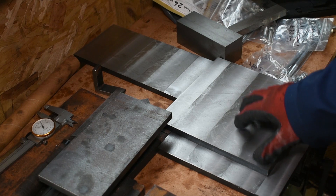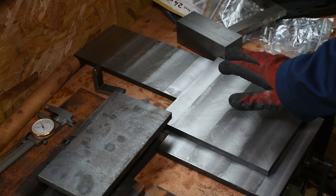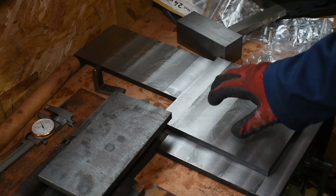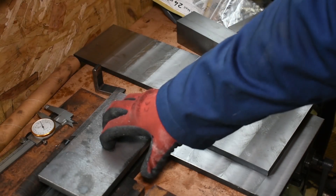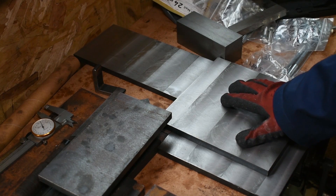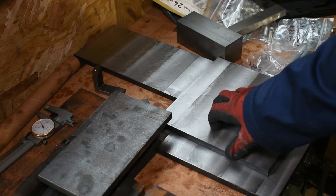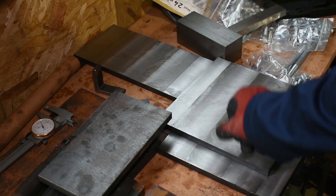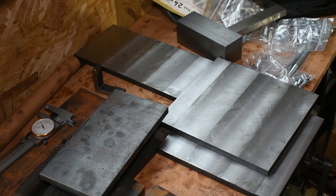What I've done from the cutting list is I've had some half-inch steel plates pre-cut laser profiled, so all I need to do is face them off and drill them. I've got a few plates already skimmed off. I've got a few more to do and then we'll be on to drilling the parts and counter boring them, drilling and tapping holes. I'm going to carry on and face off the remaining plates, then we'll move on to drilling them and getting them put back together.